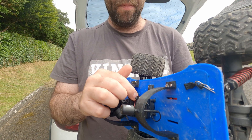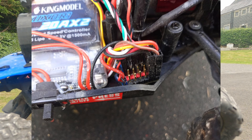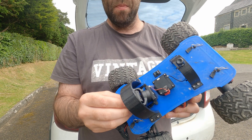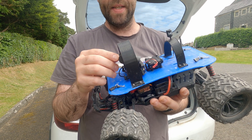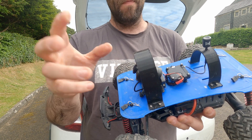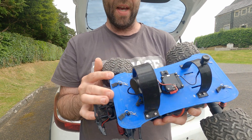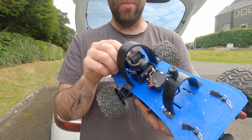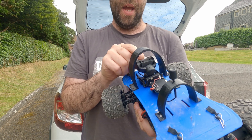I've since connected the PWM up to the receiver so I now have full PWM control. PWM 1 on the gimbal selects modes - you have three modes: an FPV mode and then the other two lock various axes, so one locks the roll and another locks pan and roll or vice versa. PWM 2 is the sensitivity, which I have mapped to a slider on my radio. Higher sensitivity means more stabilisation. Then PWM 3 and 4 are for control of your pan and tilt.